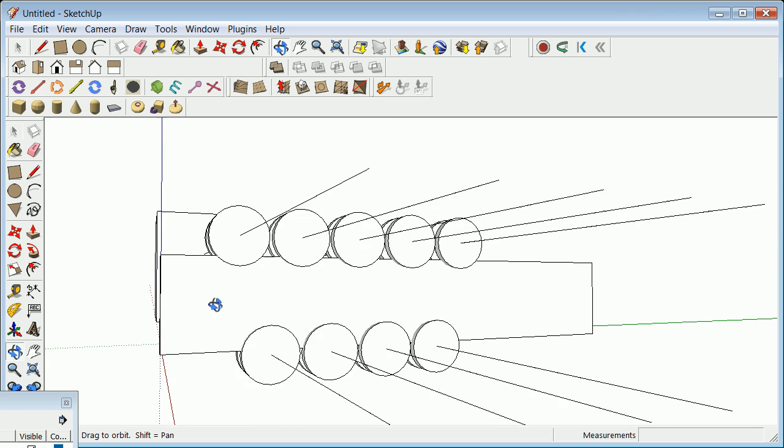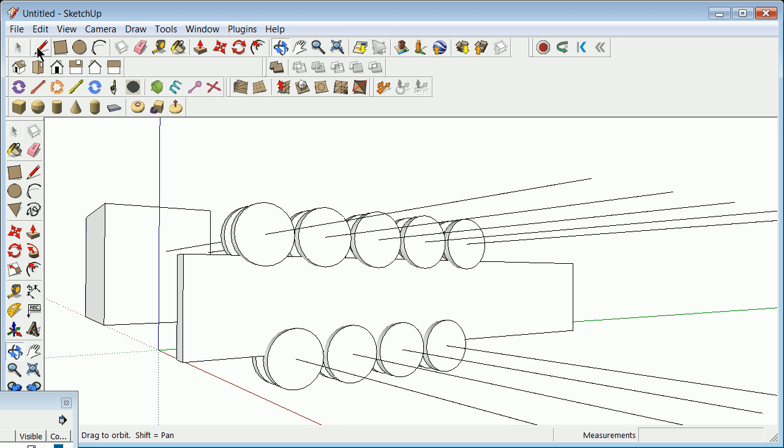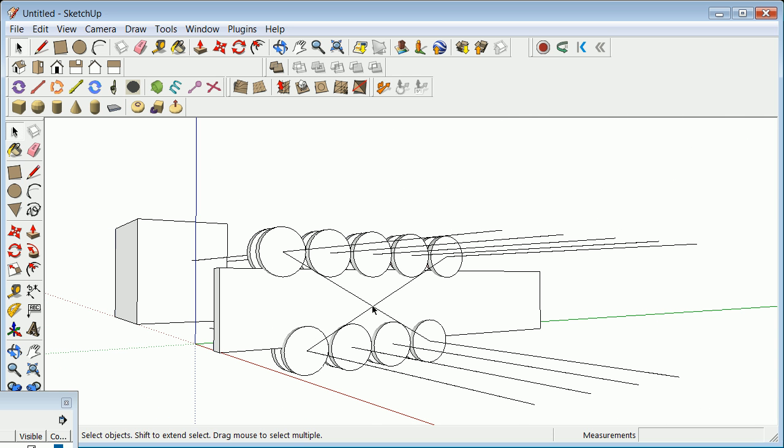So at this point, you might decide what is going to be your insert on the assembly. It might not be a bad spot to put the assembly insert at the intersection of 2 points, which would probably be something mathematically important. And it might not be a bad thing to have that axes coming directly perpendicular out or down along the edge.